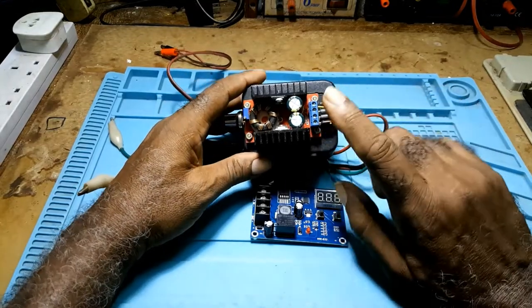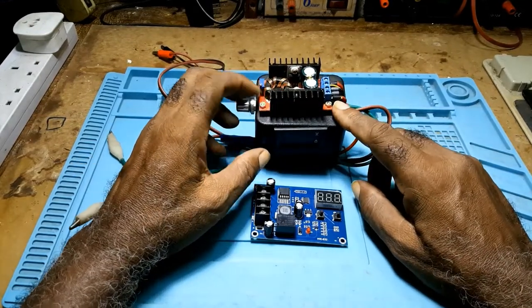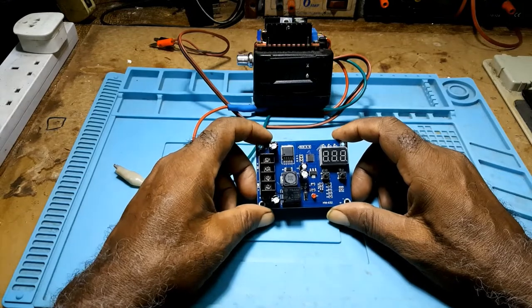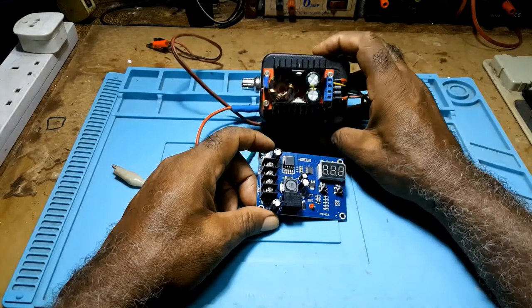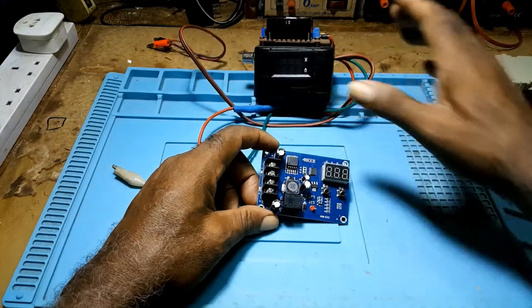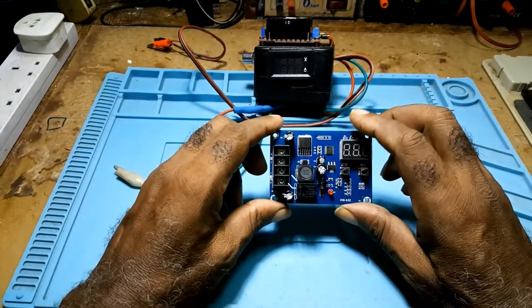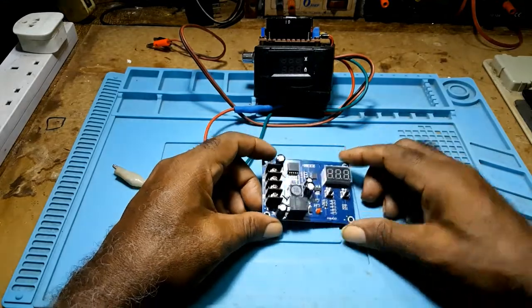When I tried this with one of these buck converters and started it at 12 volts — since this would be charging a 12 volt battery, a battery charger would be putting out 13 to 14 volts. You need to set this to 13 to 14 volts or higher so you would be able to activate the module and it would charge the battery. The input voltage cannot be lower than the voltage of the battery.